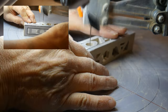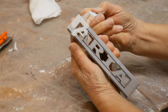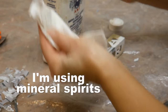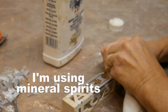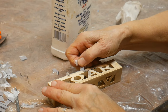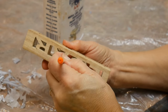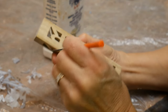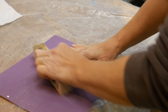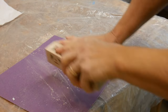Be careful not to use any clear packing tape on this, because a lot of times it will get caught underneath the packing tape to your paper and you won't be able to see. Then I'm taking off the outside of the pattern, and anything that sticks a little bit I'm just using paint thinner to get rid of the rest of the pattern before starting to do my sanding. I've used all different kinds of tools for sanding — get it on the inside and sand the outside. Gently round over some of the edges a little bit, take your time, and then I use just a simple paintbrush to clean out all of the sawdust from the inside and wipe it clean before I stain it.